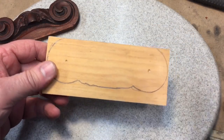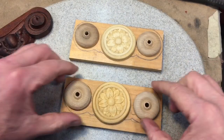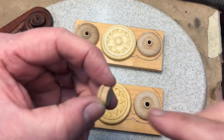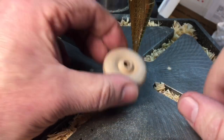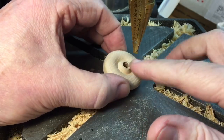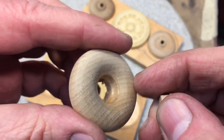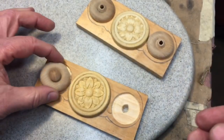Now we're going to cut those recesses in here. Do you see where we're going with this? These will go in the recess and they'll look better. Now we've got to plug these holes. I have axles — I wanted to put these caps in here, but we've got to recess that, so we're going to drill this out to this size and push those plugs in there. That'll look like a little rosette, more or less. Now to enlarge this hole — I could do it on the lathe, but I'm trying to do this with things you might have around the house. We're going to use a step drill, absolutely fantastic drill bit. We're going to go in nice and slow and enlarge this to a half inch, and then we'll try out that plug. The plug will go in here — it's almost a press fit because of the tolerances. It'll look like a little rosette.